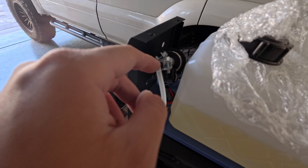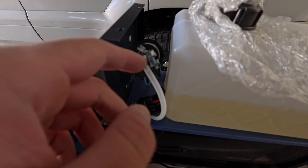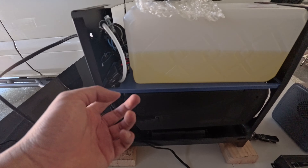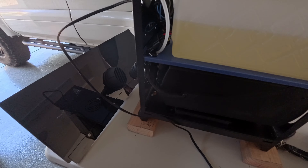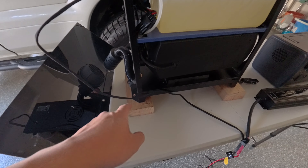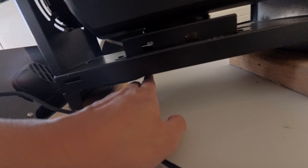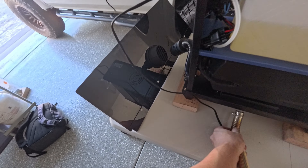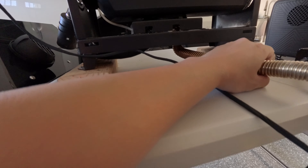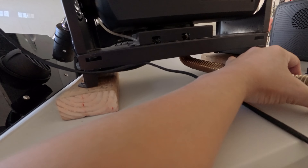It's a little rough getting the hose through the rubber hole — takes a bit of work. Maybe heat would make it easier. I also double-checked all the screws because based on reviews, people found loose parts on other units. Luckily for mine nothing was loose, but I double-checked everything just for caution. Another thing I had to do was get two two-by-fours, because the exhaust and intake hoses come out at the bottom. Without raising it up, everything basically sits on the ground. It might be a design flaw, but a little two-by-four worked out.